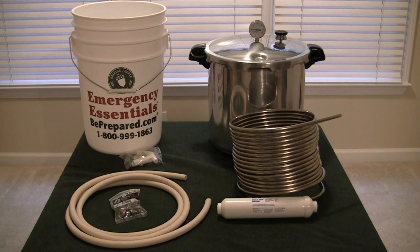I purchased the coil on the internet; it said it was an 8 inch diameter coil that was 10 inches high. It's actually a 10 inch coil that is 8 inches high, and that's a little bit large for my 6 gallon bucket. So in addition to cutting the coil in half, we have to tighten the coil up and also spread it out so we get more of a vertical run to encourage the water to flow through the tube as it's condensing.